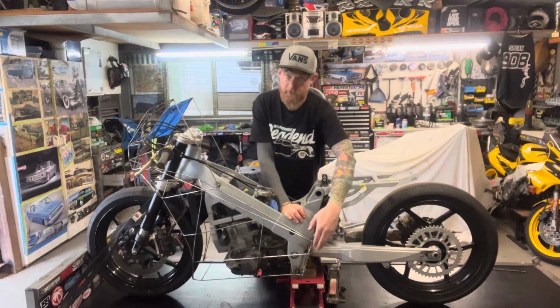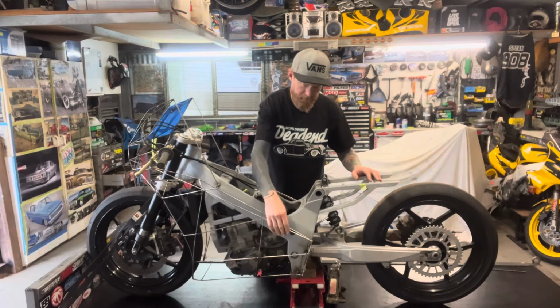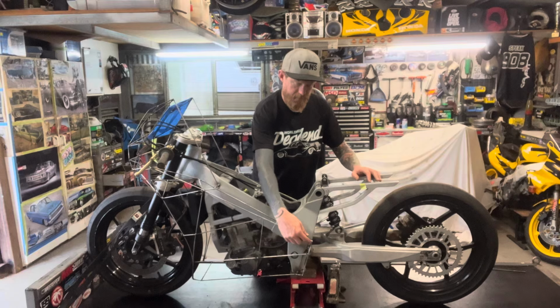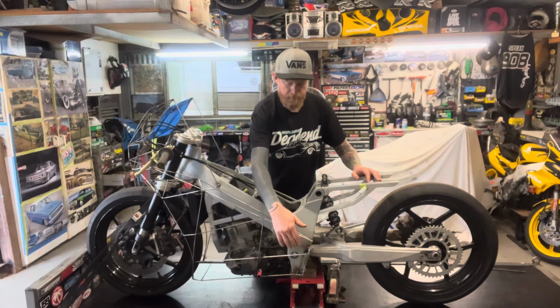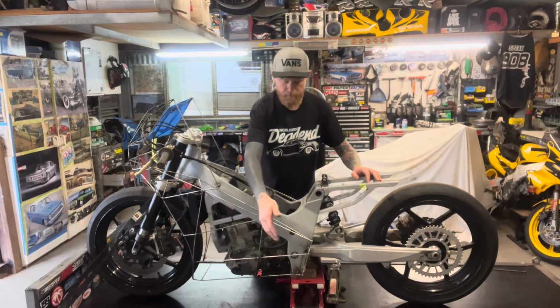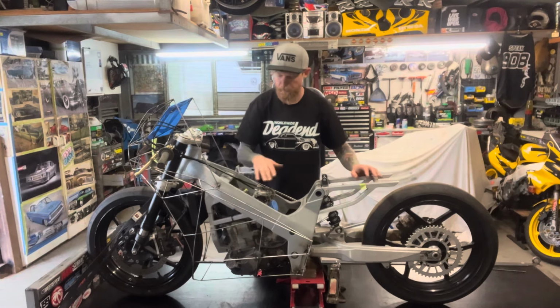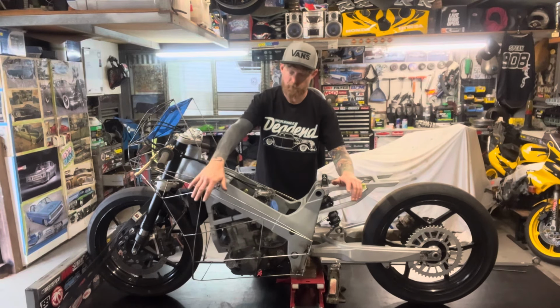I'm not necessarily going to keep it this shape. I'm going to play around with some different shapes once I get to the cardboard stage, but for the time being, for the structure, it can stay like this. For example, these sharp edges and everything in 90s. Once I'm drawing up the cardboard templates and then playing around with the final shape, a lot of these will end up being rounded off or radiused to suit what I think looks good at the time. So it's not necessarily going to be these straight square edges, but the overall shape of the fairing and size of it is pretty much what I want.